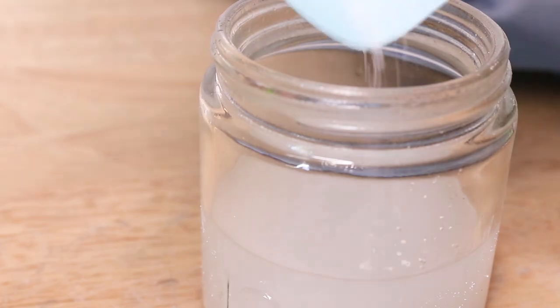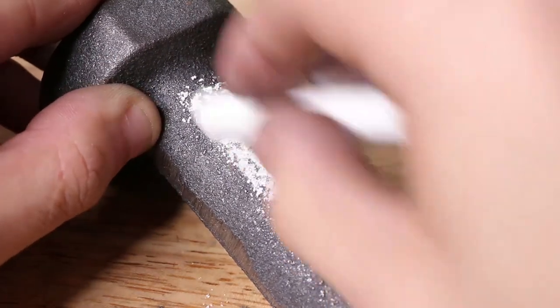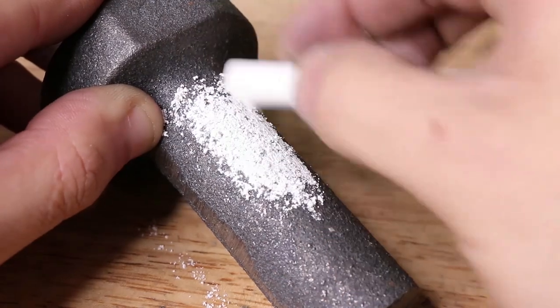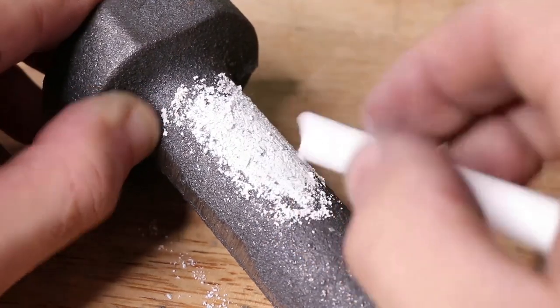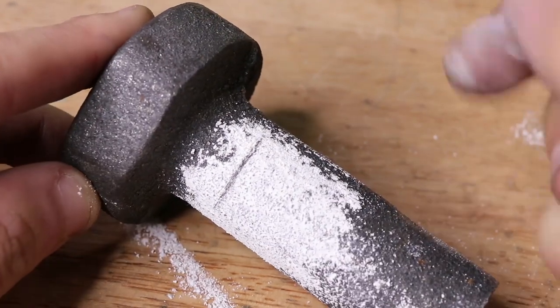And the results are, well, what you'd expect. The handbook doesn't say it, but this is really meant for porous castings, and there it works well. In fact, in porous castings, you can just rub the chalk in. But for polished aluminium, this is a pretty poor method for layout.